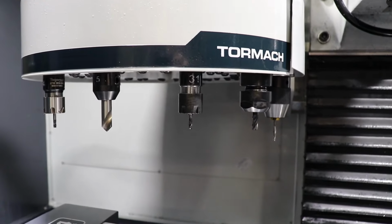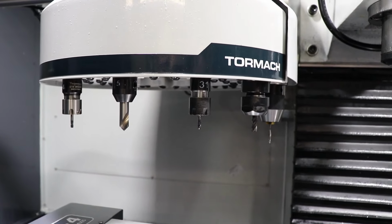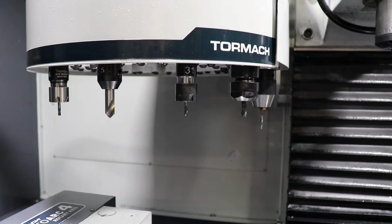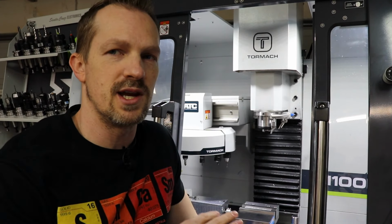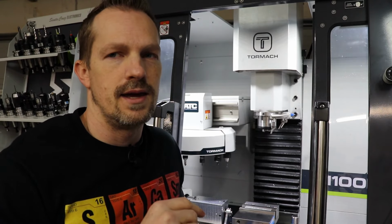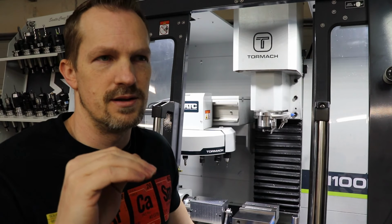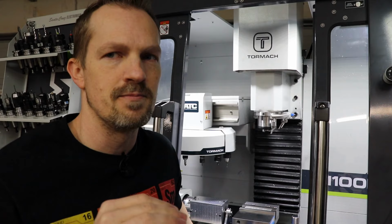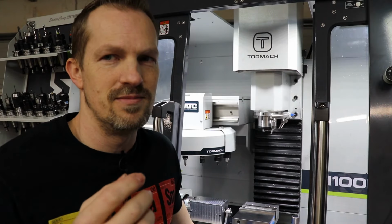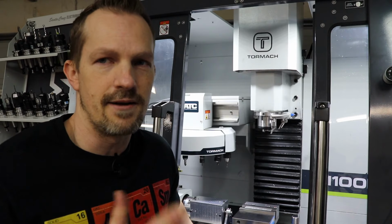These are all the same types of tools that you use on titanium, like the coatings and everything. They're all exactly the same, just some slightly different feeds and speeds. So one more thing is I've chosen to do this machining while it's in its softened state. It's a very thin part. I could heat treat it just as it is and then do the machining, but because it's being machined so thin, the tool pressures and things would possibly cause quite a bit of deflection without some really special holding fixtures. So machining most of it while it's in the softened state gets things a lot more accurate, and then I just have to do a little bit of machining after it's been hardened.